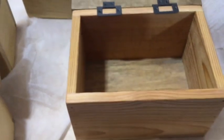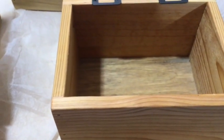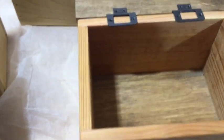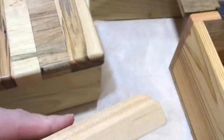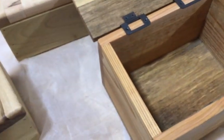I've got a bunch of other material to make boxes out of, but unfortunately half inch is really the size you want to use, and most wood is three-quarters to one inch. So you have to get rid of a lot of the wood — you have to plane it down — which I don't like. I don't like buying wood and then getting rid of it.